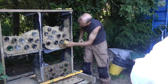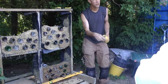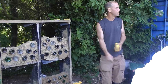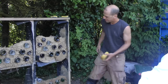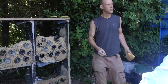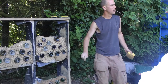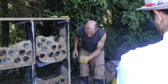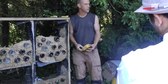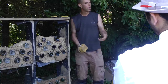The best way to get your straw to the right length so you don't have long bits sticking out is to use a strimmer with a wire attachment in a large plastic bucket — like a blender — and chop the straw into shorter lengths. This mix is really nice because we've used sharp sand, which has larger lumps of stone aggregate a couple of millimeters in size. Even using a sponge it starts to shine those up, and if you oil the wall at the end, those little flecks of stone add a beautiful feature. If you want a matte finish instead, use regular building sand.